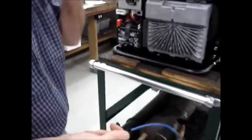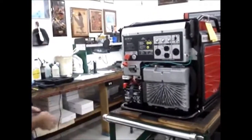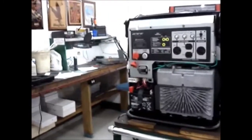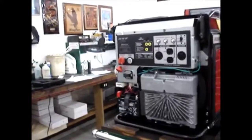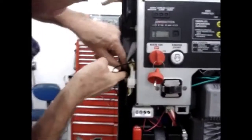This blue wire, as you remember, used to connect this circuit breaker to this outlet. You'll no longer be using that. And this is the original plug that was snapped into the remote control harness, and you won't be using that now. So you can set both of those aside. Let's not forget to put the plastic cover. You'll notice that this cover has a hex cut into it, and that goes over this 6mm nut just to keep it from rubbing through the wires.